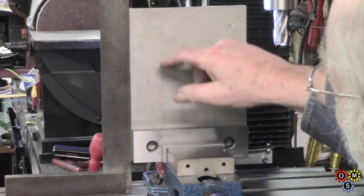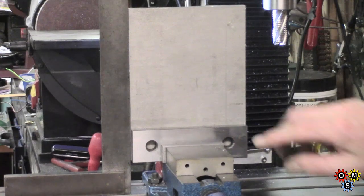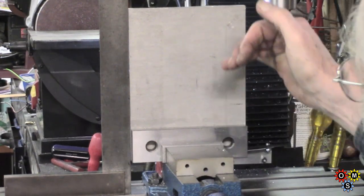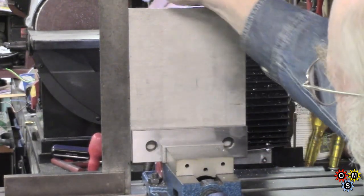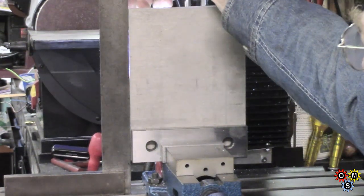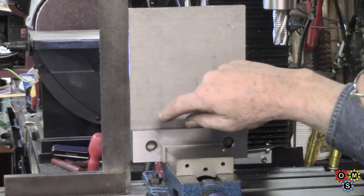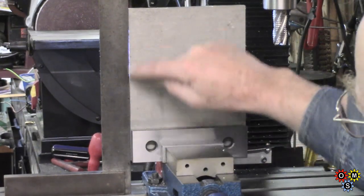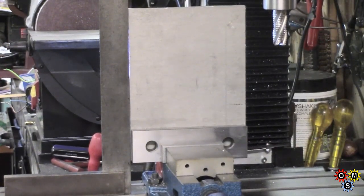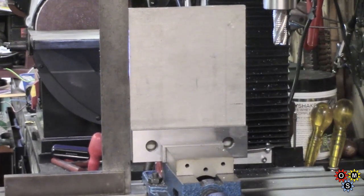I was going to indicate the side of this to get my top, but it's a bit tricky to indicate for that on the Z axis, a bit tedious anyway. So I've got my large square and a light behind, which gives me the visual gap. In fact there was only a very small discrepancy and I've got the better side down - this side is bad. So that's worked out pretty good and I'm not making this to ultra accuracy, I just want it to be good.